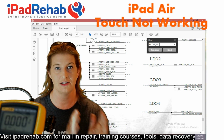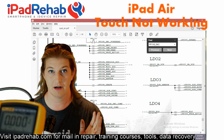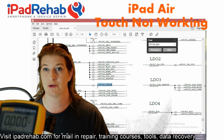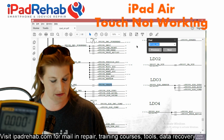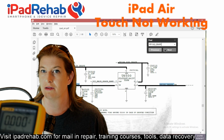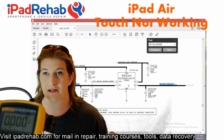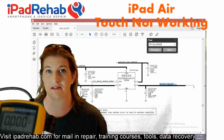The PMIC generates PP1V8SW2. It doesn't go anywhere until it gets renamed, and it gets renamed PP1V8 grape. Then after it gets renamed, where does it go? It goes here, to our little chip, our U6500 chip, and it knocks on the door, ding dong, do your job. U6500, start putting out your output.